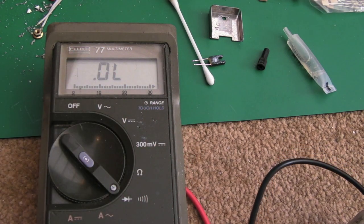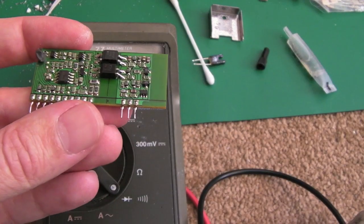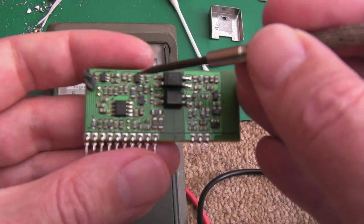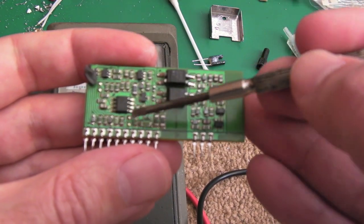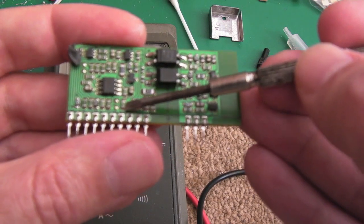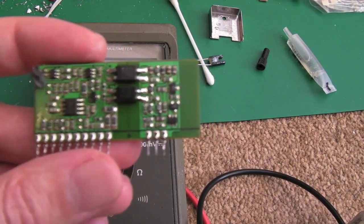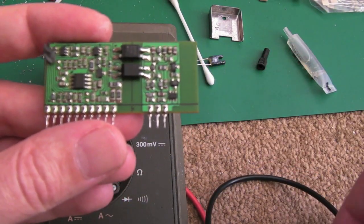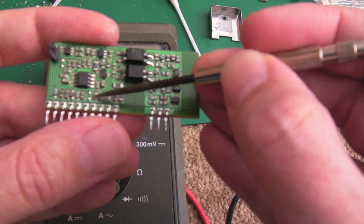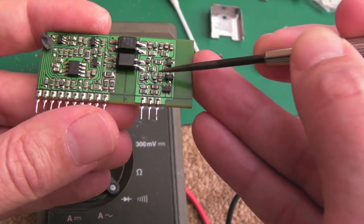Anyway, I'll just show you something else actually on this PCB. I'm not sure how close I'm going to be able to get without blurring, but I did spend some time going through some of the components on here. There's lots of 0-ohm links, they're green, you can see there. It wouldn't surprise me if you had a fault on one of these where certain aspects are not working, you know, a voltage has died or it's completely dead. You may have one of these that's blown, these 0-ohm links, the green.